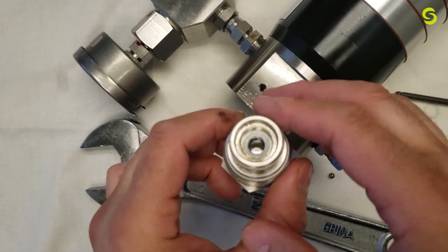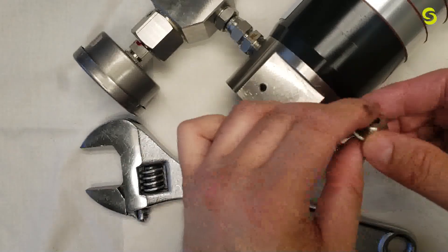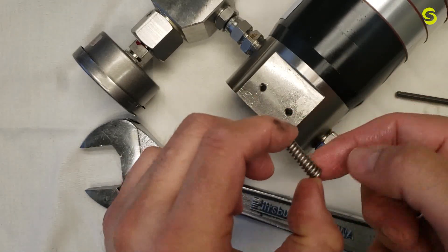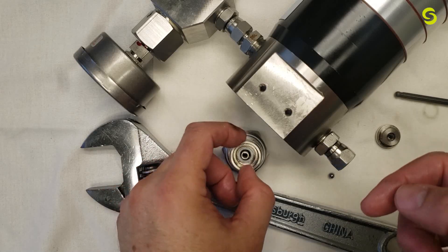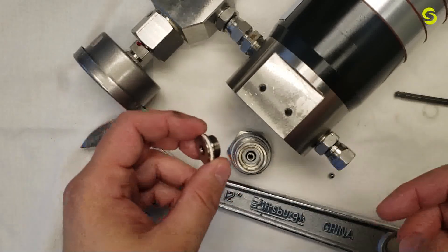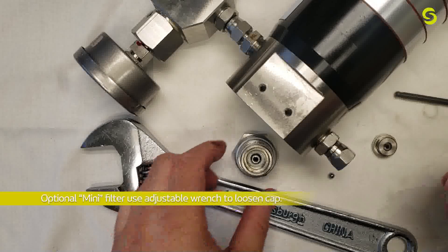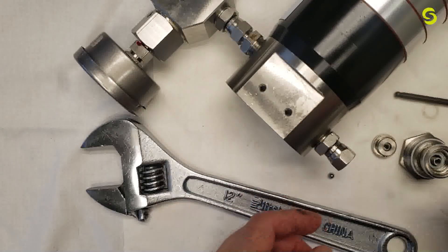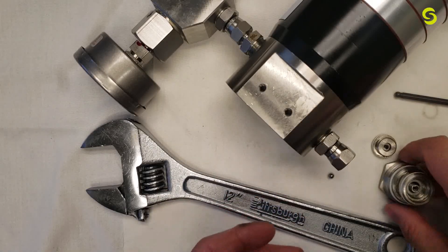When reinstalling the O-rings, use a small amount of grease to prevent damage. When installing the spring, make sure the conical spring has the small end where the ball sits and the large end going into the body. Put the ball back, reinsert the inner cartridge, screw it down with the 6mm wrench, then reinstall. This new design allows for better cleaning, a smaller orifice, and improved flushing so the ball and seat stay cleaner — and it's a very easy disassembly.